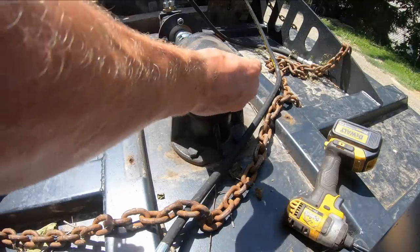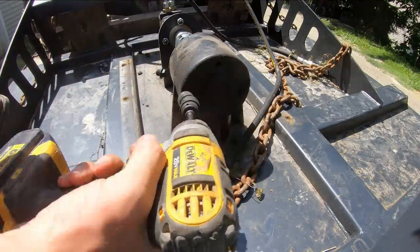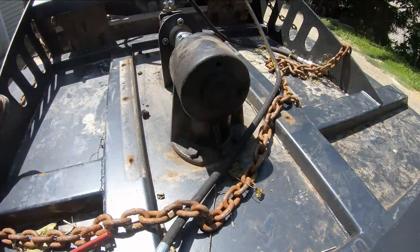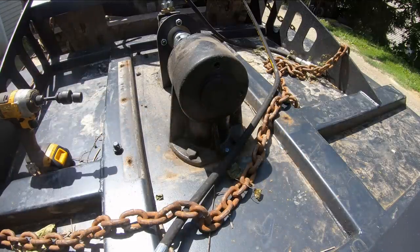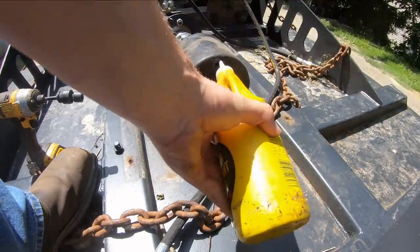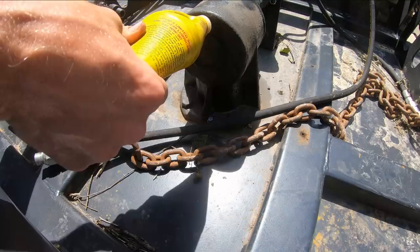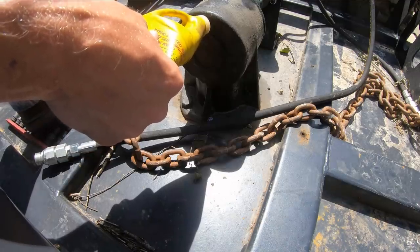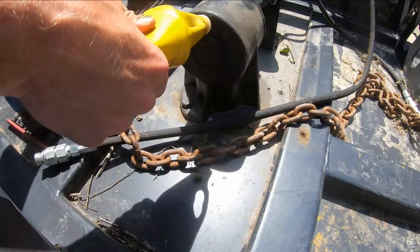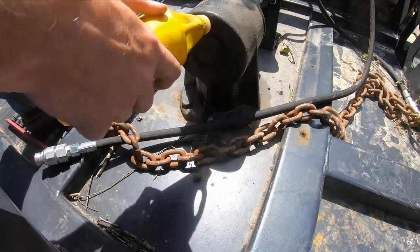You don't need to tighten the fill plug — it's just an extreme duty brush cutter. There's one plug out. The level plug is a different size. Unreal, I'm getting frustrated here. Well, there's nothing coming out, so we'll start adding fluid and see how much it takes. I've put in a good bit so far — most of the bottle — and still nothing coming out. I bet this gearbox was slap empty. I'm glad it did lose the blades, because I'd have played around out there and run it without oil in the gearbox.